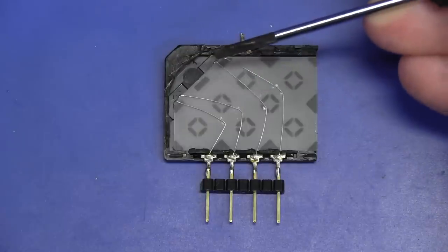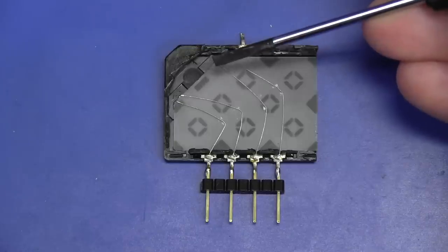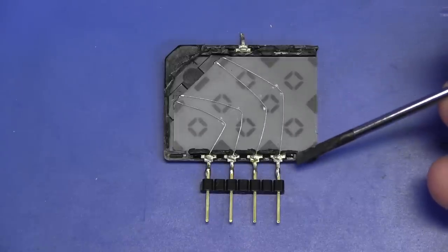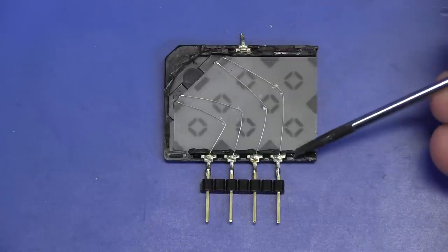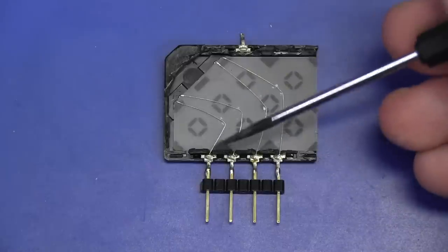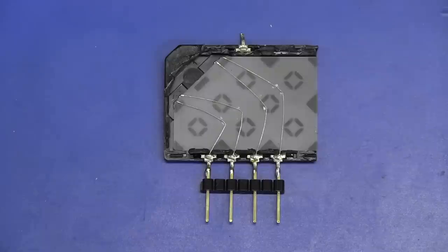As we said, if this one is transmitting, the shear wave inside goes down through here, bounces off this wall, bounces off this wall — because these are oblique angles, they come in at oblique angles so they can actually bounce off the wall. So it goes all the way through there like that: bounce, bounce, bounce, bounce, and back out.